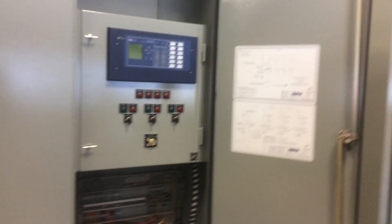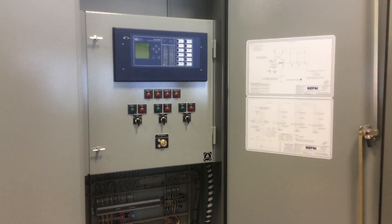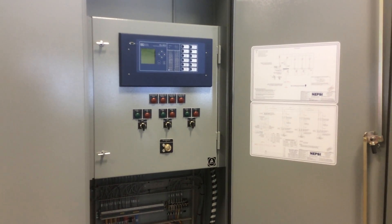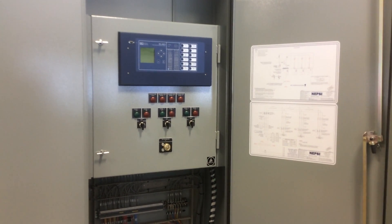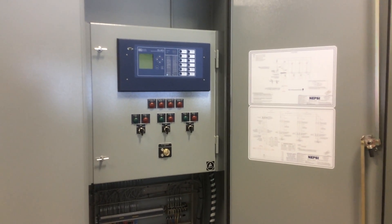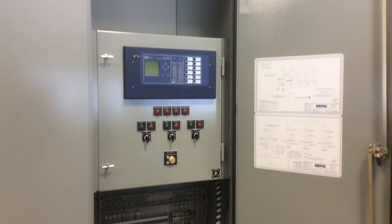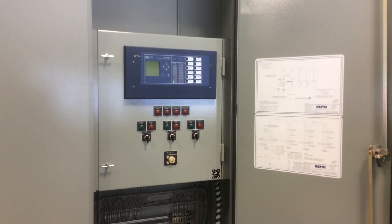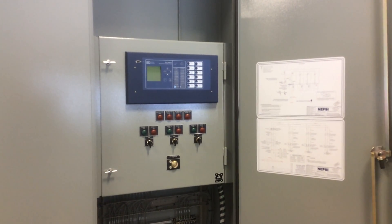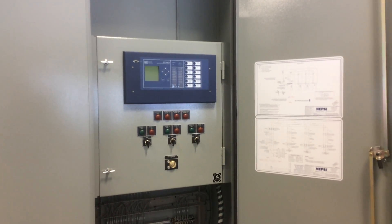Once this is accomplished, you need to wait a minimum of five minutes. The reason for this is to allow time for the capacitors to discharge through their internal bleeder resistor. Sometimes there's an actual timer and the key is not available before the five-minute period. In this case there is no interlock, so you'll have to count that down — again, a minimum of five minutes.